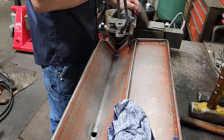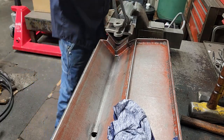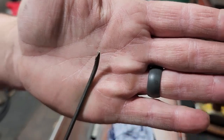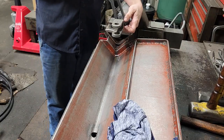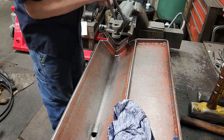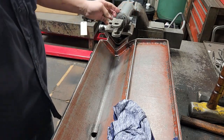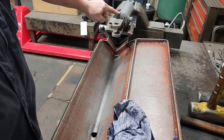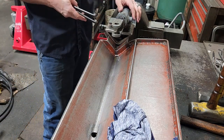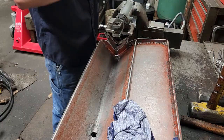Okay, I've got a pick here that has a flat ground on it. I'll get up under this so that when I rotate it, it comes out past the OD of the tube — the outside of it — and now we just rotate it all the way out.